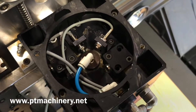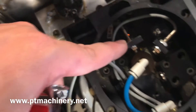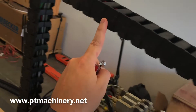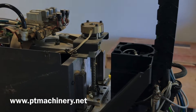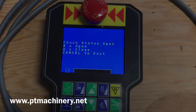It's just a matter of getting that plunger close enough that you don't touch it — you can damage it — but it'll cause that sensor to turn on. The machine will see that the plunger is in position, meaning the chuck is open or closed, and it knows when it's open and closed — that'll allow you to do the tool change properly. So that was really all it was: replacing the sensor, making sure it was working, and then wiring that through the E-chain and back to the position on the wiring board, just matching the numbers up. Label those so you know for next time, and you're good to go. Now we can button this up and do tool changes without any interruptions. Thanks for watching, hope this helps.